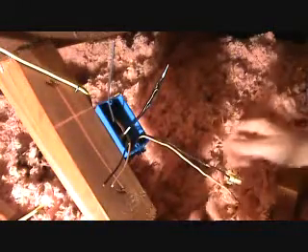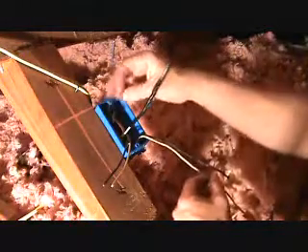I'm going to wrap this with electrical tape — it just tells somebody that if they ever get up into this junction box and they see this white wire connected to a black wire, they'll know why. Because we're acting as though this is a black wire.